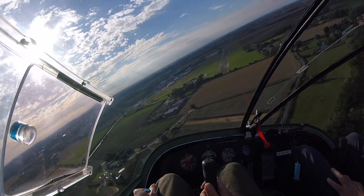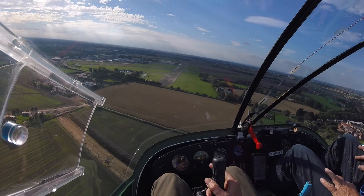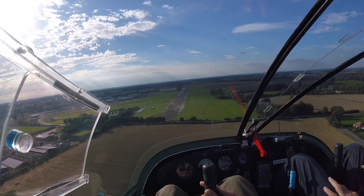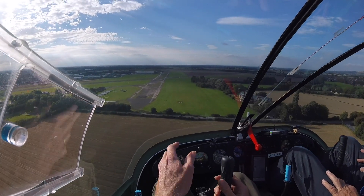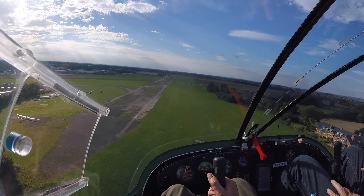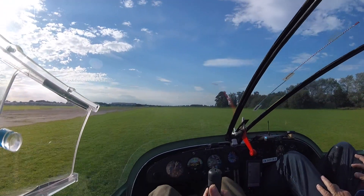What we need to recognize is that the judgment of when to open that half to two-thirds air brake is actually quite difficult. So what we need to do is play with it while we're up high, so that we can achieve a reasonably steep approach when we're down low. Here we are on the approach — we try the brakes and see what happens. Maintaining speed, we find we'd undershoot massively. So in this case we shut the brakes and fly on a bit. This thing's got amazing air brakes. Maintaining 50 knots, 50 feet over the road, we then recalibrate, maintain the speed, and it comes in very steep at the end — nice and safe.